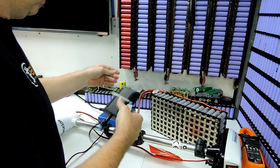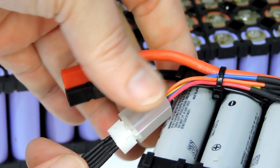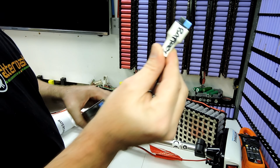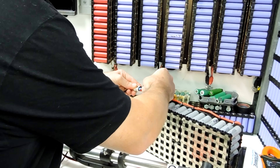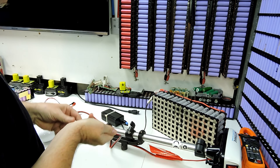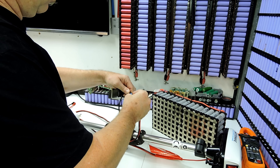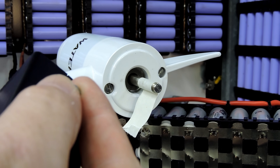My brother has built a PWM controller to regulate the amount of power going from the battery to the Water Snake. All that we've got to do to run this is unplug it here, unplug the balance leads, then plug in the battery — blue is positive — then plug the Water Snake in and turn it on.